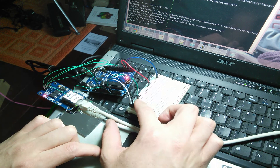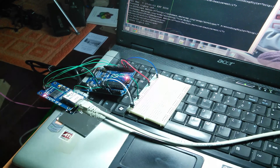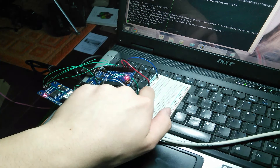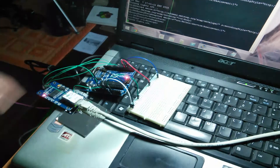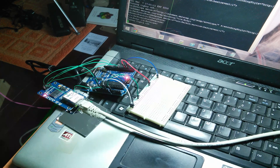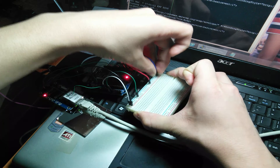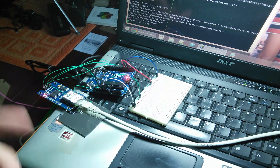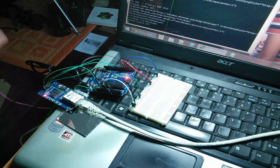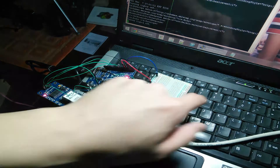Right now the lights are off, so this is in the ground position, which means the Arduino thinks the lights are off. This red wire corresponds to the motion sensor, or passive infrared sensor. It is connected to ground, which means there's no motion. If I were to connect it to 5 volts, that would mean there is motion. Finally, the blue switch is the door — and actually I just realized it's connected wrong. When this blue wire, or the door sensor or reed switch, is connected to ground, that means the door is closed. If it's not connected to anything, that means the door is open. That should not be connected to 5 volts, ever.